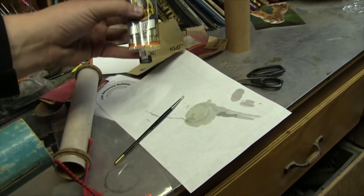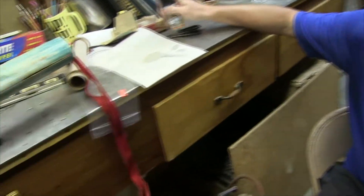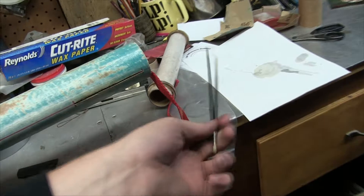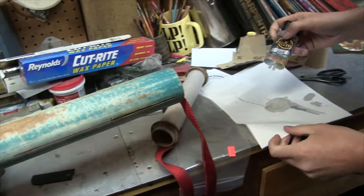The Gorilla Epoxy is going to be put to use again. Mix up some epoxy. We're going to use this brush to get it in as deep as we can, hopefully lay a pretty sizable amount so it'll kind of craft a fillet around the front here. Hopefully we won't have to try and feed anything from the top. Should be pretty solid.